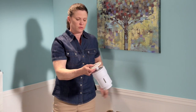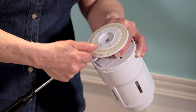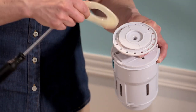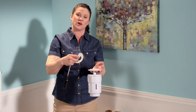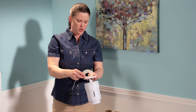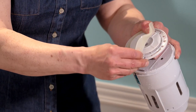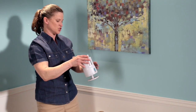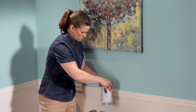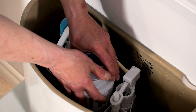The only part you need to replace on this style flapper is the bottom rubber. I'm going to take my flathead screwdriver and reach in the bottom of the rubber. This rubber is very flexible so you can use a little bit of pressure — and that's it. You can purchase that at your hardware store or from the manufacturer that made the toilet. Simply take the new flapper, stretch it over the hole. Now we need to position it back inside of the tank, on a little bit of an angle like you did to take it out, then twist it so it's straight.